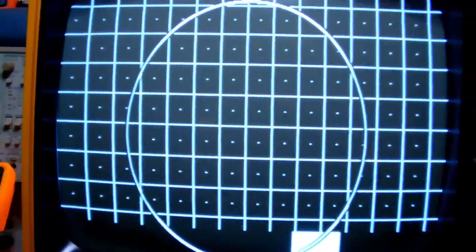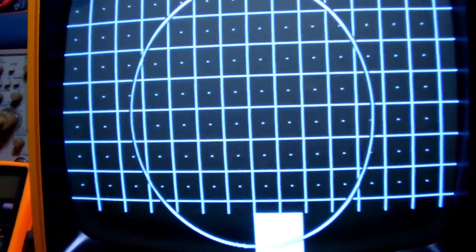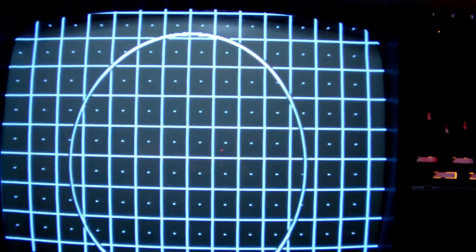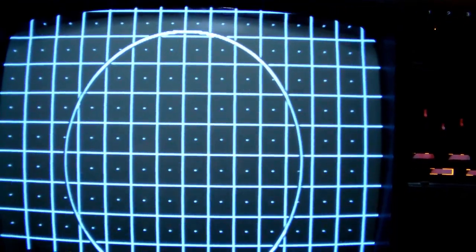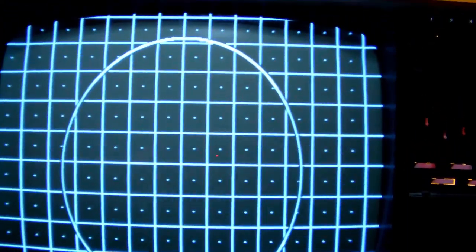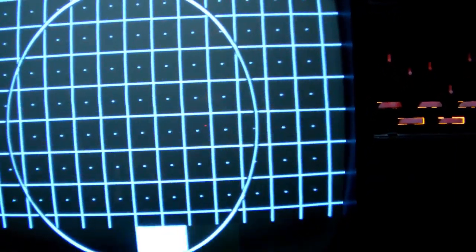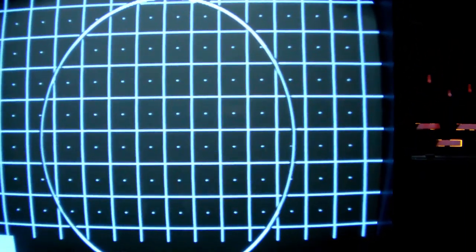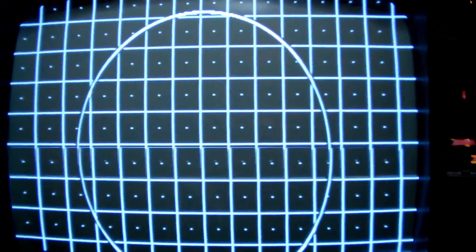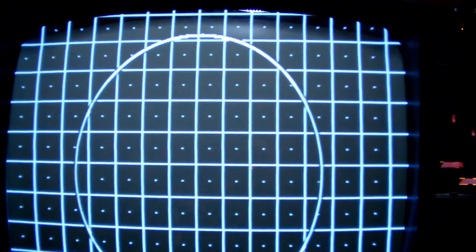Alright, so I rotated it clockwise, and I would say I am nearly there. I think I over rotated it now a little bit too much. So I need to go back by maybe half a degree counterclockwise to correct it. So I think we're almost there. If I look at the convergence pattern, it looks okay, although not quite perfect yet.